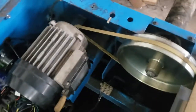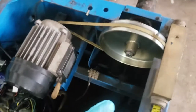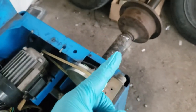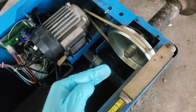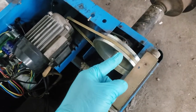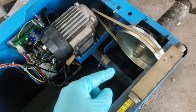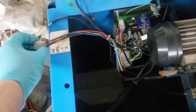You've got some piezo ceramics — kind of hard to see. There's one that's extremely dirty and then there's another one deep down there, hard to see. Those are what are actually measuring any minute deflections with the tire — that's how it detects the balance. Any deflection in the bolts touching the shaft will translate into voltage differences, which get sent back to the machine through one of these wires.